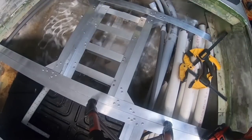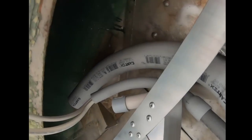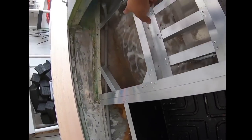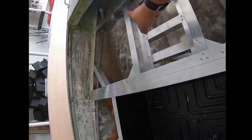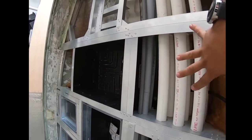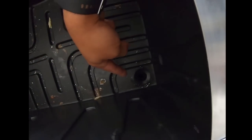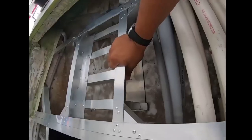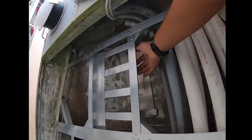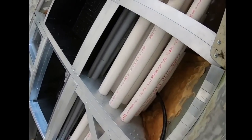Not to mention that all the totes and all the foam reaching under the frame give it substantially more strength by itself. We have conduits running through the system. We have to add one more conduit over here running for the actual 6-gauge wire to the trolling motor. This is going to be a trolling motor bay. Once we pour foam in these spots, it will stiffen up that bay substantially, and then we're going to do something about these grooves so it only channels right into the drain port there. The recessed pedal mount that we mounted into here is all set and ready to pour. Once we pour, this will stiffen up substantially, and we'll be able to cut it flat before we add the final piece to it. All these tubes, all these conduits are ready to go.